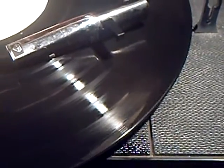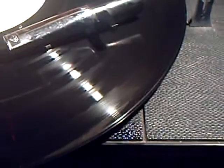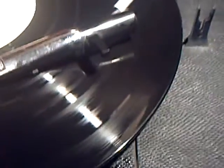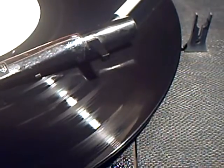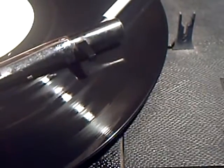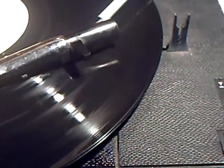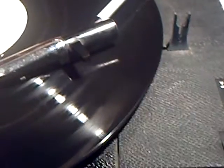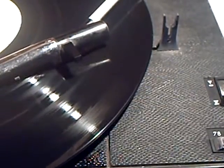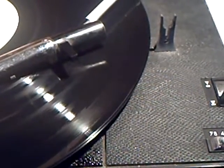It's got the usual old-fashioned plug-in head shell, which was rather nice because if you wanted to, you could fit a flip-over stylus, so you could play LPs, 45s or 78s, just flip the stylus over for 78 and away you went. No trouble at all. Can't do that with the China-made crapperphone one, alas. No, and don't try playing 78s with the needle they supply, because if you do, next time you play your precious LPs, you might find that it doesn't sound quite right, shall I say.